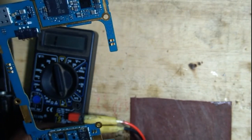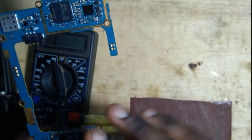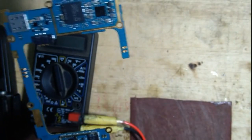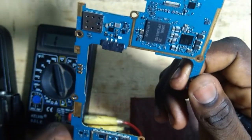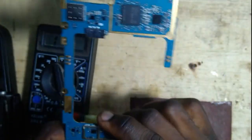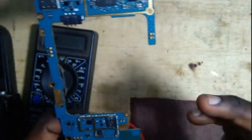The stripes on the sides indicate negative and positive — it stores current and filters DC current as well. Then we have the network capacitor, which is found in the network section of the PCB and is made up of two or more non-electrolytic capacitors.